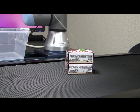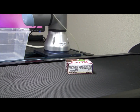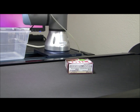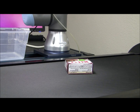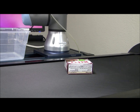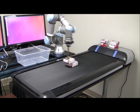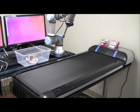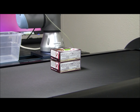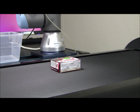For our last example, we'll pick boxes from stacks of varying heights. A 2D vision system like Roboteek's has no awareness of Z-axis height. If we train the Roboteek camera to recognize the jello box, we are inherently training it to look for that box at an assumed Z-height — it has no ability to visually distinguish the top box of a stack from a single box. This means that if we train it to pick up a single box and instead present it with a stack of two boxes, it will crash through the top box in an effort to pick up the bottom one. Here's a close-up view: it crashes through the top box and then properly picks up the bottom one.